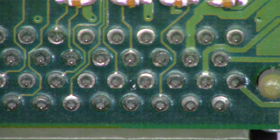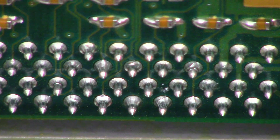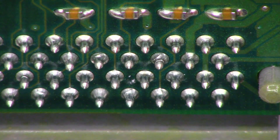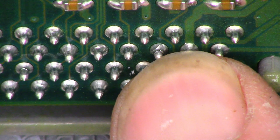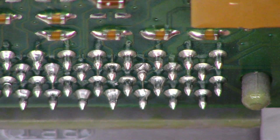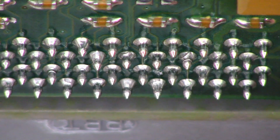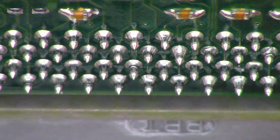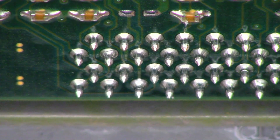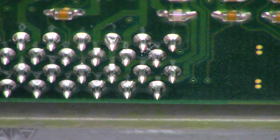Let me tip it up and see if it'll focus when I pick it up. You can certainly see how well each pin is actually soldered. I am seeing something on that one right there — I might want to re-solder that pin. I think I see a ring going around it. From the feel of the coating on this board, it's just silicone RTV — like they just painted it with RTV. You can see a bridge of silicone between those pins, but I don't think that's going to hurt anything.